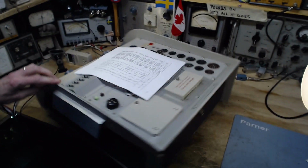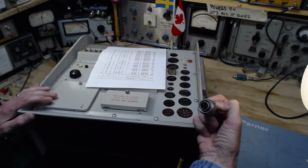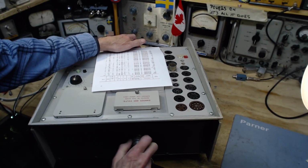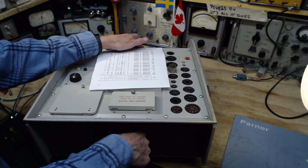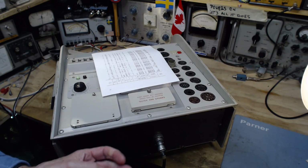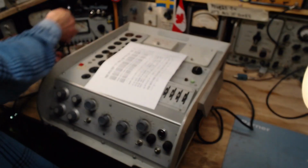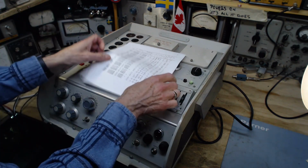There's key marks on the outside here. There we go. So I'm going to plug this in on the assumption that whoever put the plug on the end knew what they were doing, and the machine has been set for North American voltage, 120 volts. I'm going to use a dim bulb system to prevent a disaster from happening.